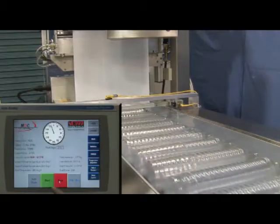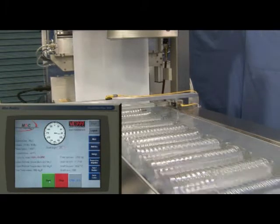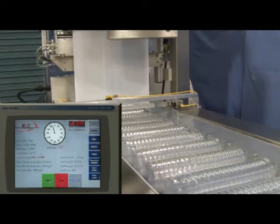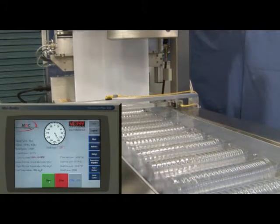Timing functions are controlled by a virtual shaft angle generated by the Allen-Bradley control system, allowing each station to function independently. This feature helps make development of DOE and validation effortless. In addition, the unique feature of overlapping functions will allow for higher machine speeds.